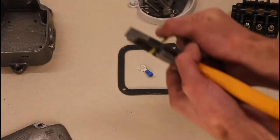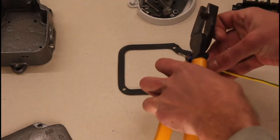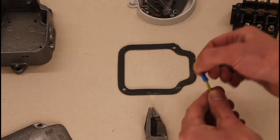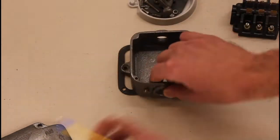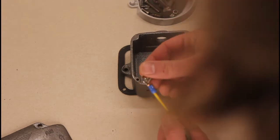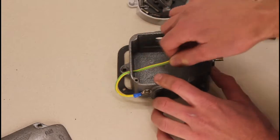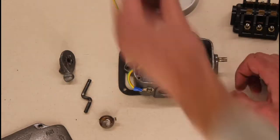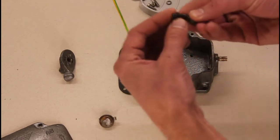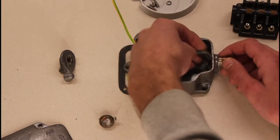Now it's time to put it all back together. I'll start with the earthing lug and make a new one. Seeing as how I lost the footage of restoring all the internal components, I may as well just tell you about it: the rubber seal that was a little bit degraded — I ended up restoring that just by bathing it in some sewing machine oil. It's a really lightweight oil; it managed to seep in and revitalize that vulcanized rubber. I did clean all the screws as well — bathed them in contact cleaner along with the armature device — so they should all be good for another 50 or so years. Now I've got to get the spring lever arm back together so we can have that mechanical action back.